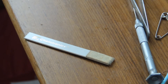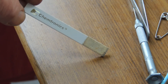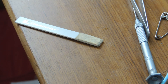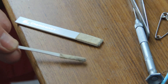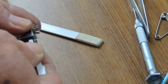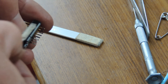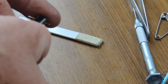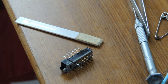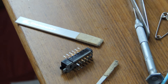I thought I'd just show you this: instead of using a cotton bud, because they were leaving fluff, I've started using a cut-down Chemtronics chamois leather — or artificial chamois — plastic stick, cut down to a small size so it will go in the right end. With a bit of cleaning solution you can virtually burnish the inside contacts. I assume these are silver-plated, and as you can see on the outside surface it's all tarnished due to age — that's obviously what's happened inside the switches too. With a bit of cleaning solution and abrasion from a cut-down stick we should be able to repair all these switches.